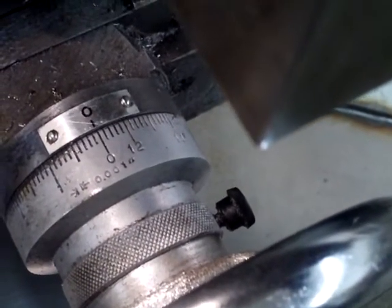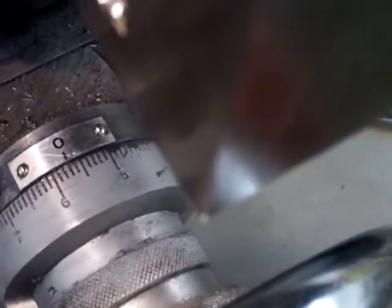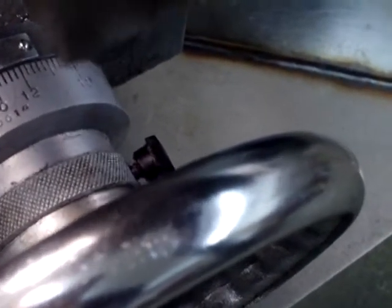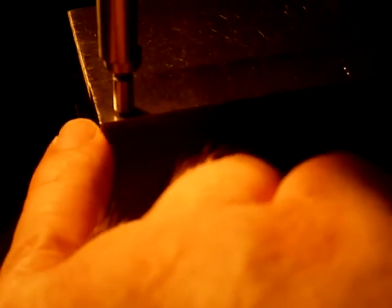So we go into the y-axis. It's still set on zero. I'm going to turn it one-eighth of an inch in. I can see it on my display better. There's zero. So now the center of that wiggler is actually beyond the fixed vise jaw right there. So when we put it up against this surface, it won't touch this worn-out lip right here that I can feel with my finger.